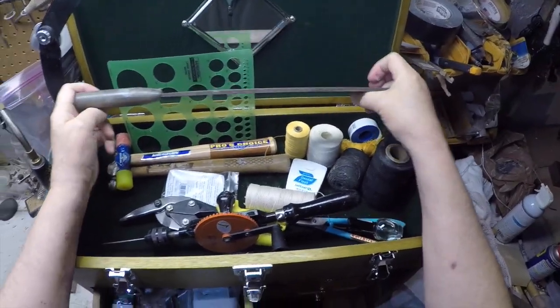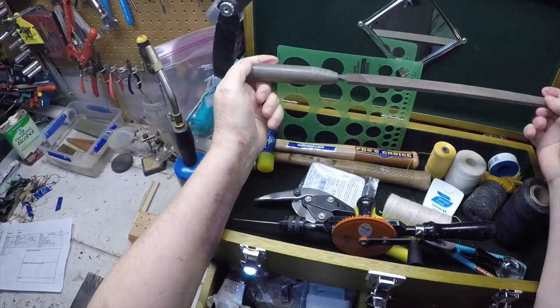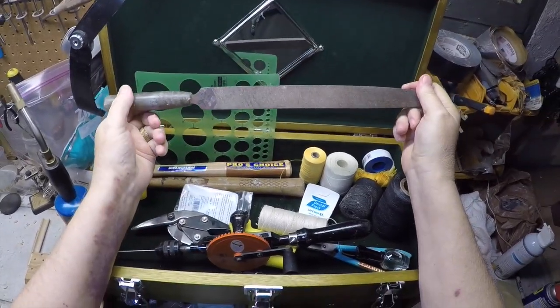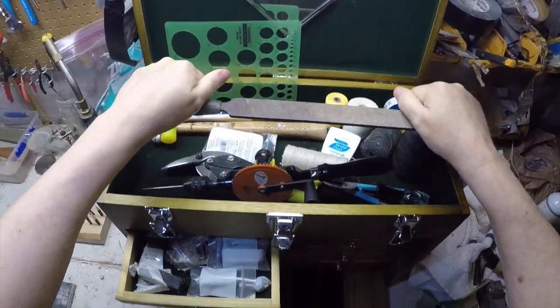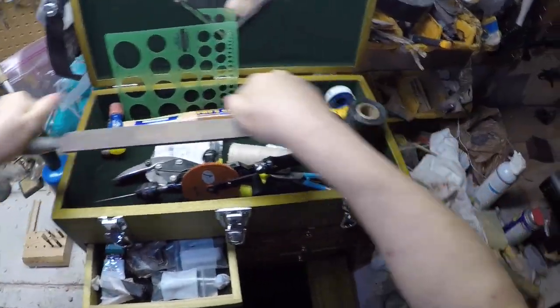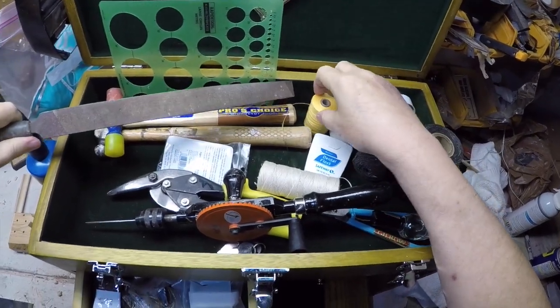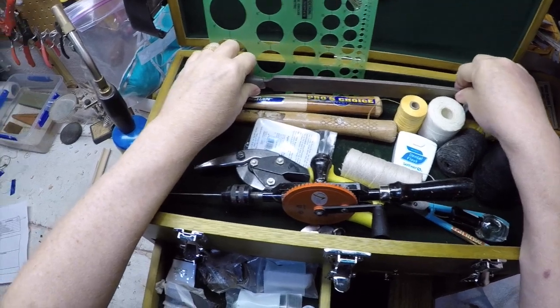This is a great tool — it's a big honking file. I got it at a used tool store for two dollars, and I use it for rolling the staples. It does a really good job. You put some weight here in this hand, roll back and forth, and voila — you turn crummy-looking rolled copper into nice tubing.